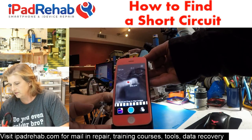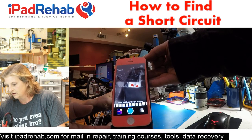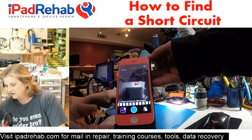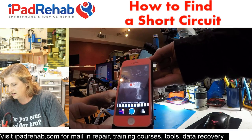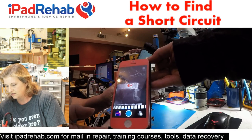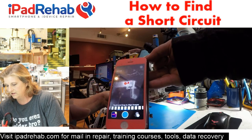All right, what if we flip it real quick? Well, it's hot everywhere. Where is it the hottest? Well, it's definitely not in the bottom half of the board, but we see heat at the PMIC. It's definitely here at the PMIC, and then it also seems to be around here, and then up here by Wi-Fi. Maybe this is a Wi-Fi short.